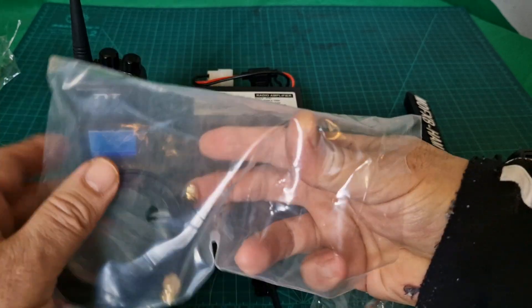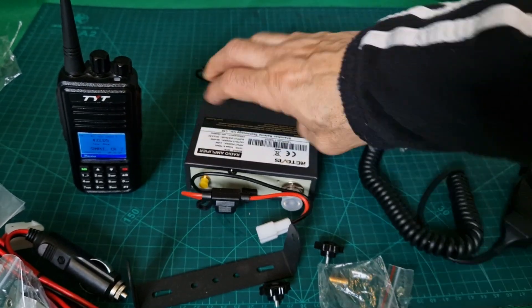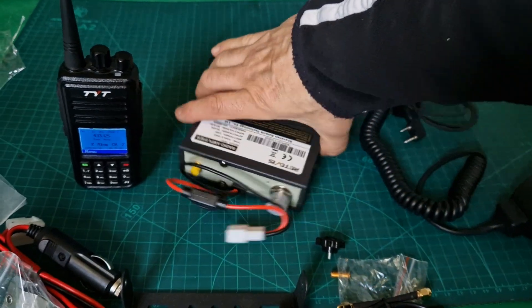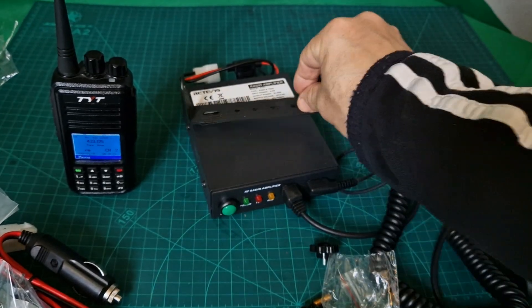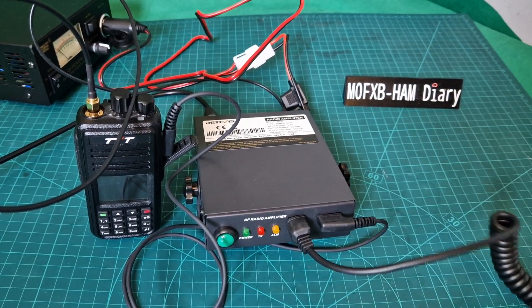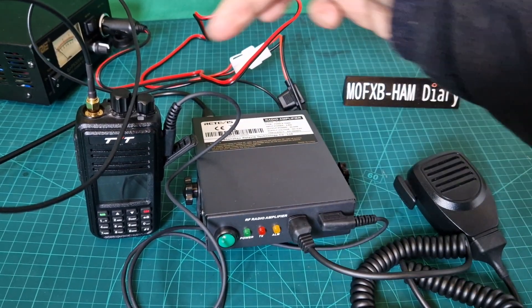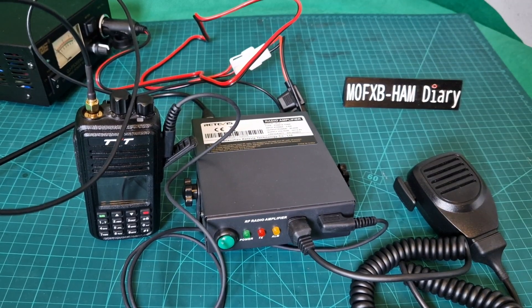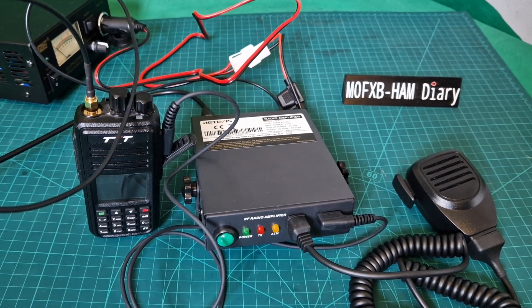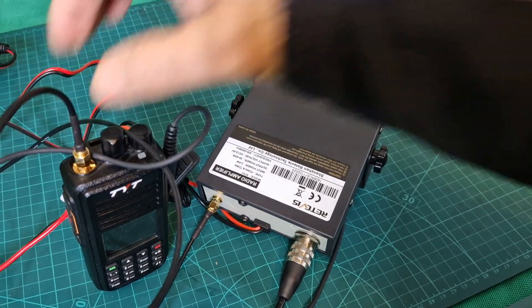On the back, your antenna goes here. I'm working out where the cable is going to go — we'll get to that. Let me get the mobile mounting bracket connected. The microphone — a nice chunky microphone — goes to the microphone connector. The twin-pin cable is firmly pushed into the radio, which is a TYT MD-380, the 70 centimeter version. You can also buy a two meter one.